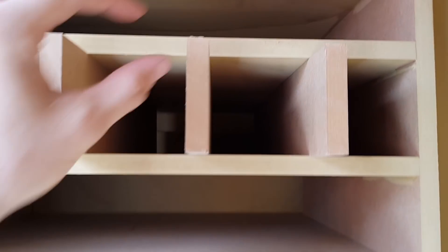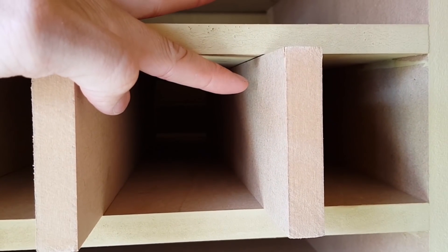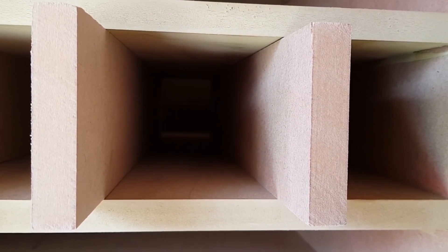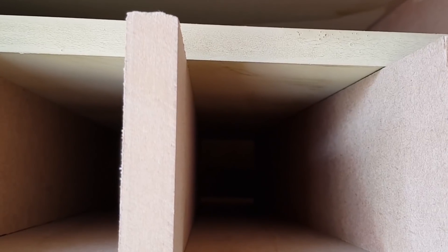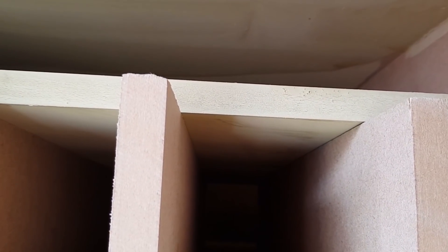This wall's been painted — you can see it's a different colour. We've painted the tops, the sides, and that goes all the way down throughout this end of the box. When the cells are in here, they come up to about a centimetre and a half from the shelf above, which is much closer than I'd have liked. But the top of each cell only has a fuse on it, so as long as the fuse isn't touching the wood, that's fine. We painted it to ensure that if the fuse wire got hot for an extended period, the wood wouldn't start to burn.